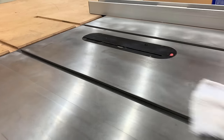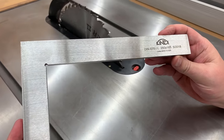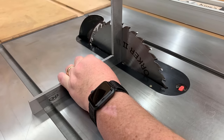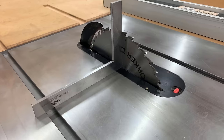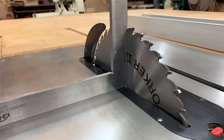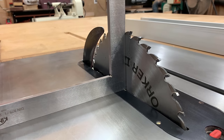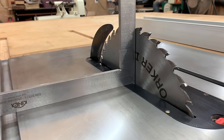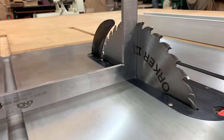Once the surface is perfectly clean with no dust in the way, I want to check the blade. I'm using a stainless steel square. I have an electronic indicator showing where my blade is on the saw, but I always manually check it every time I return it to zero. Since this is a tune-up, I'm doing that here too. I'll adjust the blade bevel back and forth until I get it perfectly straight, and once it's dialed in exactly I'll reset the indicator below the saw back to zero.